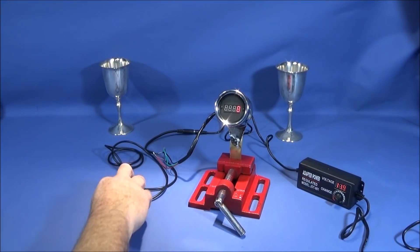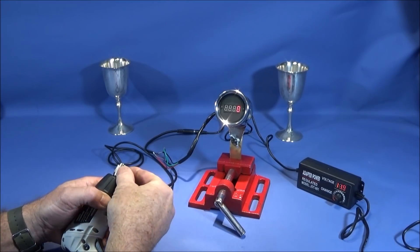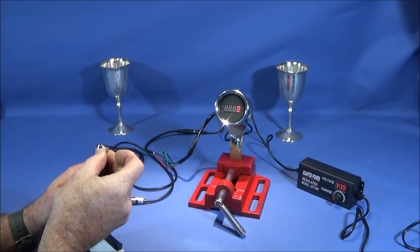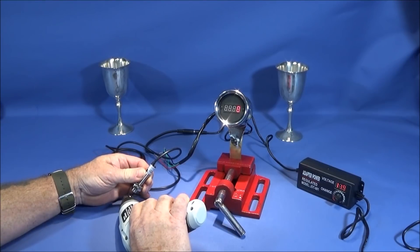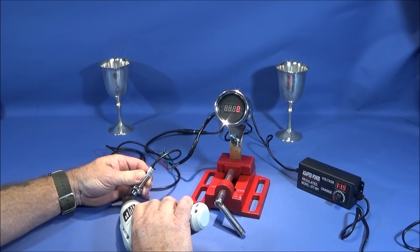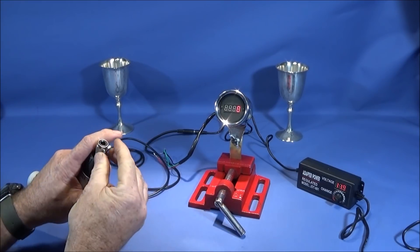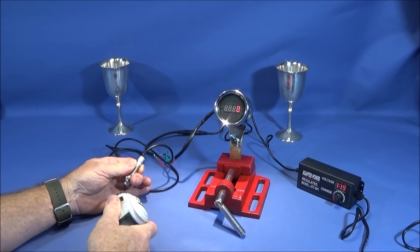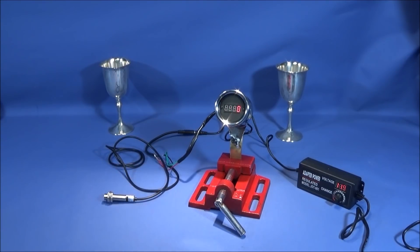With these proximity switches, you must have the magnet facing the right way. If it doesn't work one way, turn it the other way — I'll show you so the polarity is round the other way. If I hold the proximity switch up to that now, you won't get a reading at all. Turn the magnet over and stick it on again and it works perfectly.